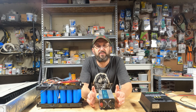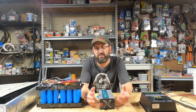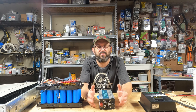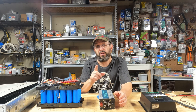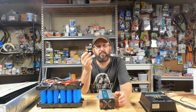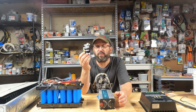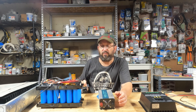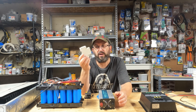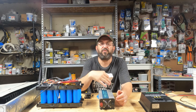This is a simple, inexpensive build that any good DIY person could do. Now I say DIY person because you are going to need other things — fuses, wires, some tools. So if you have experience building DIY builds, this is going to be the best way to do it. One thing you've got to watch out for: when you're building a 48 volt build, don't use 48 volt circuit breakers. This system is actually more than 48 volt, so you have to use higher voltage circuit breakers. Also be careful to hook these up correctly, because they can be dangerous if you hook them up wrong. Make sure you use circuit breakers and fuses that are rated for more than 48 volt.